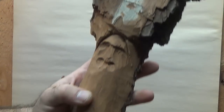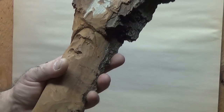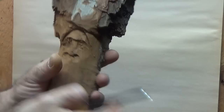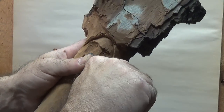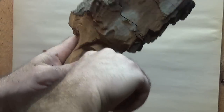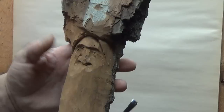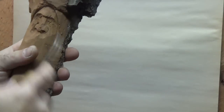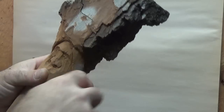Another tip on the gouge and applications for it, like I said, in doing noses, it's really nice. If I took this gouge, let me just set this up for a minute, and I flipped it over and inverted it, and I have a carving like this and I wanted to make nostrils in the nose, I would flip it over and, on those wings of the nose, just push it in. Again, the circle on that gouge is going to make a really nice round wing of the nose. You can cut out from underneath there. It's a quick, easy way to get some noses started.